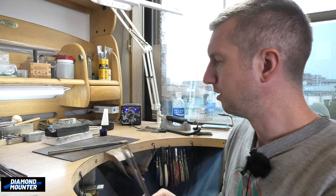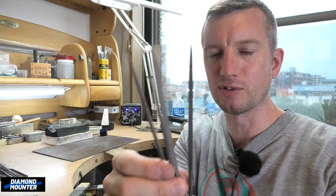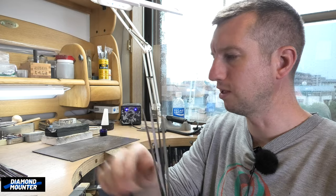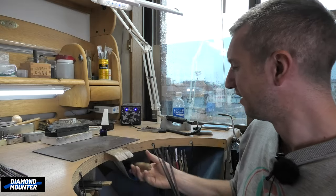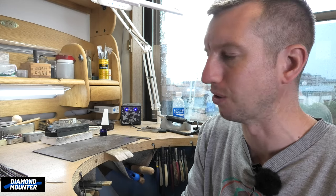Out of all these tools, from my perspective doing the kind of jewelry I make on this channel, you can get started and follow my videos with really just these tools: a 600 grit buff stick, and four needle files - tri-square, safety back, round, and square. And a ring file as well. Just those. Hopefully that can save you money if you're looking to start out. Watch out for those beginners packs from trade suppliers that have loads of stuff they say you've got to have - you don't actually need it.